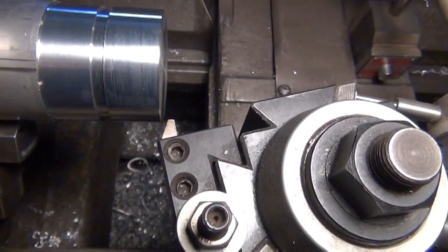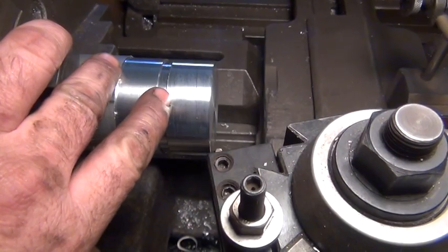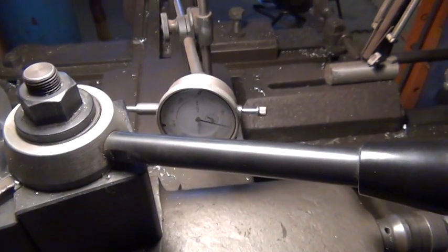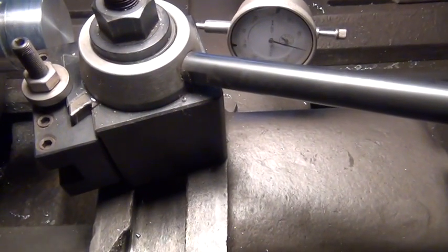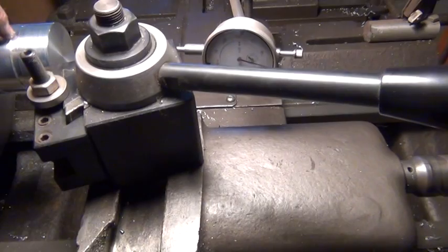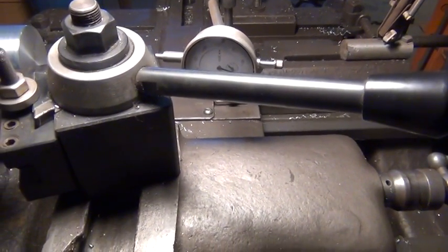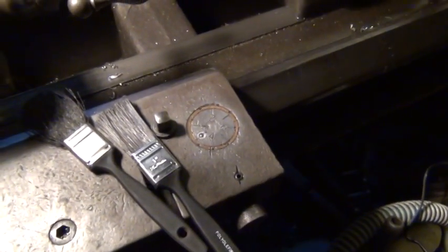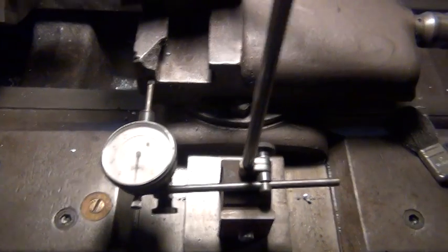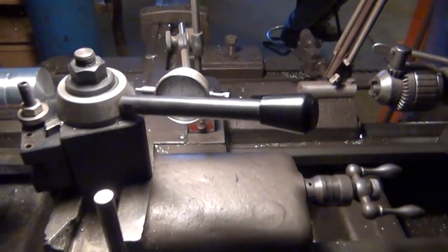The other one should be Acme instead of square threads. Most places this is a newer piece and they haven't used square threads for a lot of years. We're going to try Acme on this. I don't think it really shows up in the video, but there's two little light lines here where I tried it with another bit, just to check the two threads per inch. I've got my relief cut to depth, and I've got an indicator set up here — the compound is actually set perpendicular to the cross feed, so I'll be feeding in a straight cut. After I get the first set of threads to depth, I've got to move it 250 thousandths in, and that'll offset me by 180 degrees when I engage on the thread dial at the same spot. I've got the dial on the compound and this indicator is set for zero, so I know when I get in — my threads are actually 48 thousandths deep — I'm going to go almost 50 to get a little bit of clearance.